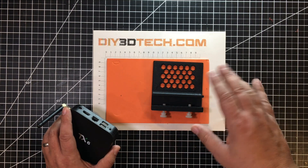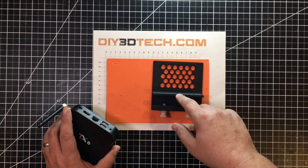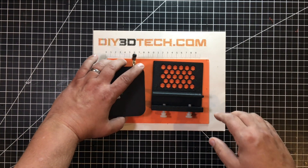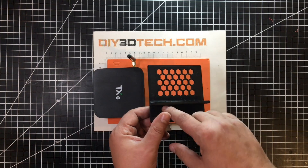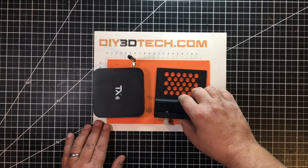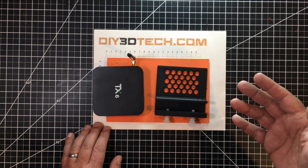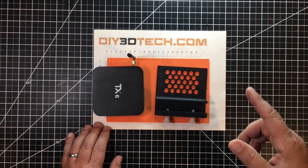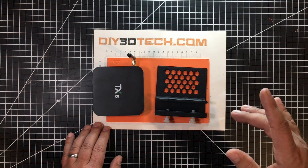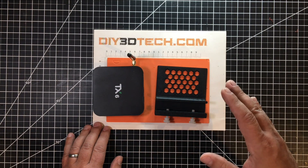So if you want to change it, you can. These cinch on there, so not a lot of force goes on this one per se — most of it will go back here. The other piece that I did is I filleted all these inside vertices to give it extra strength. That's one real big thing I like about Fusion — how easy it is to fillet. I'm also going to be doing some stuff on FreeCAD, and I'm very close to making my decision on that, so look for another video. But the filleting function is really, really cool.